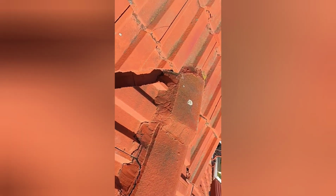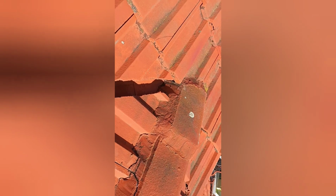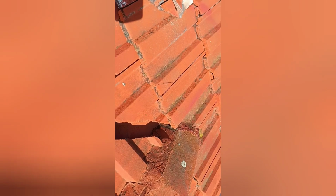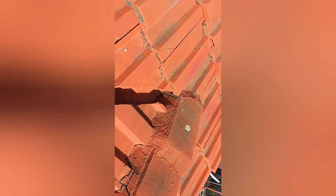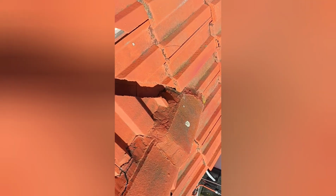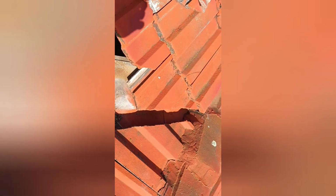The reason we haven't done that very top bit is because you've got to break all the ridges to do it. So if you're doing your ridge caps, you can do that, but it's also generally the least affected by the weather because it doesn't hold any of the dirt and that. The water just runs straight off it and it gets the least amount of water. So that's why we're not doing that. It'll slide up, go well under that, right up to the top there where that join is, so you won't even have to worry about it. I know it's dark. I don't know whether you can see that join right there. Okay, but that's where it's going to go right up to. Okay, let's get onto it.